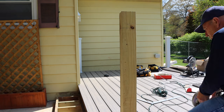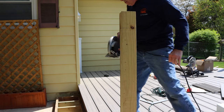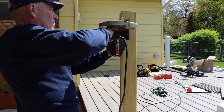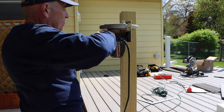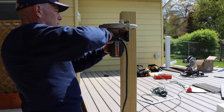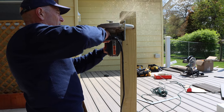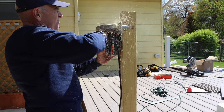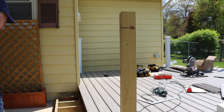We're going to grab our circular saw. Now this particular circular saw will not cut through the entire 4x4 post — it will cut about three quarters of the way through. So we're going to make our first cut on one side, lining our blade up on the marks that we just put in there. Does it have to be a perfectly smooth cut? No, it can be fairly close but it doesn't have to be perfect. So we're just going to cut along the line all the way through.